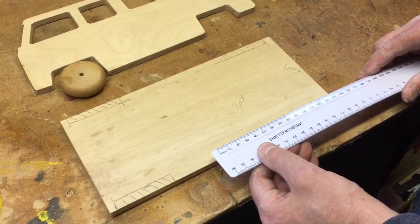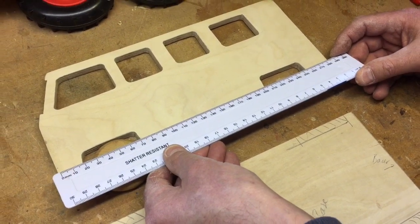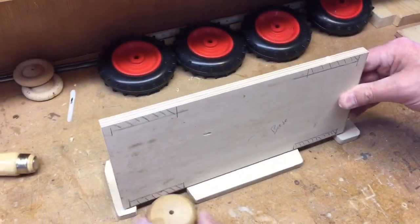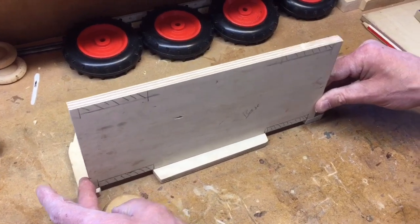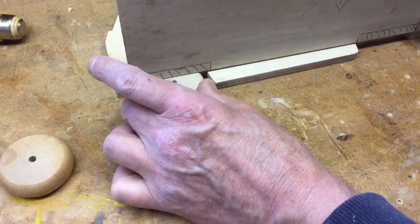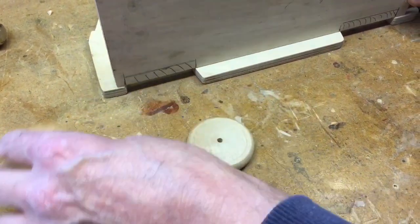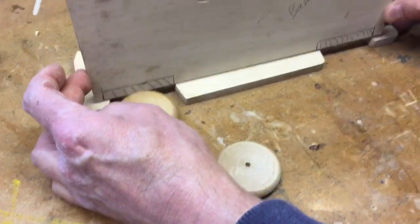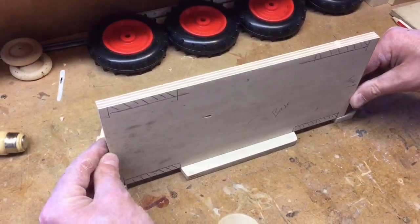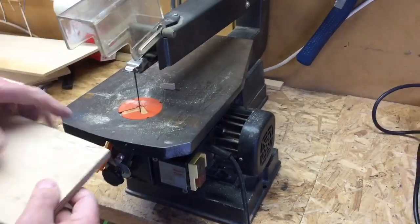Dad, how do we help Ellie get to the next stage? It's a little bit more complicated. We've got the overall size — it's just under 300, 190 millimetres long. There's the wheels we're using — you can buy these online. There's the base — it's going to sit on level there. Mark where the wheels will go. We'll cut out this to allow a bigger wheel to go in. Just mark it out in line with the actual frame you've made, whatever shape you've done. I'm just going to finish off all the cuts from the base.